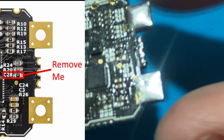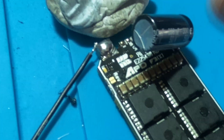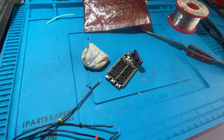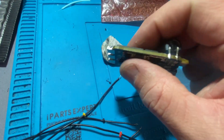When tinning these, I like to go through and fillet them fully from one side to the other, and that way you're binding up all those layers of the circuit board, spreading the power.